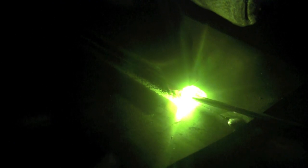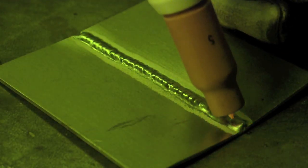Now I've switched the machine over to the AC side. We're welding some 63 thousandths 6061-T6 aluminum using a 4043 welding rod, 3/32nds in size. The first thing I notice is the high-frequency start is just beautiful — no erratic starting, nothing weird going on with the arc. It's just a very nice, tight, focused, easy-to-use arc that lets you lay down a very clean stack-of-dimes look. I'm using the foot pedal, and as I come to the end of the weld I start to lift — there's a lot of heat in it. The pedal is very progressive as I lift, then I let the shielding gas take over to cool both the weld and the torch.